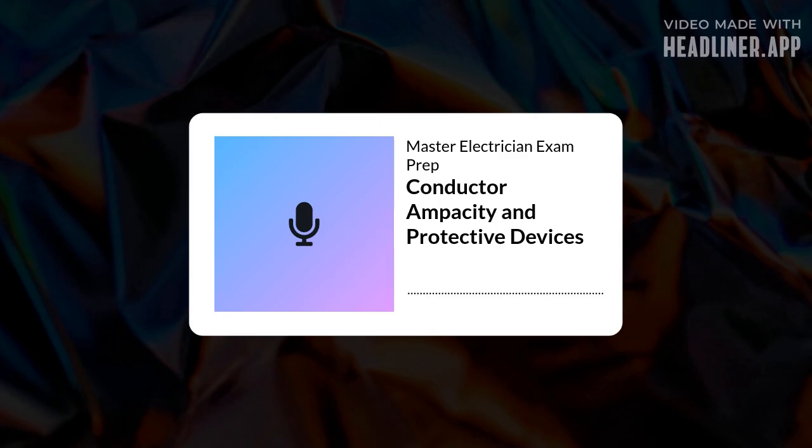Makes sense. Let's quickly cover the fuse types again. Plug fuses. Mostly older installations. Edison base are the standard screw-in type. S-type are rejection base, meaning you need an adapter, and once a specific size adapter like 15A is installed, you can't screw in a larger fuse, like a 20A or 30A. They come in ratings like 0-15A, 16-20A, and 21-30A.